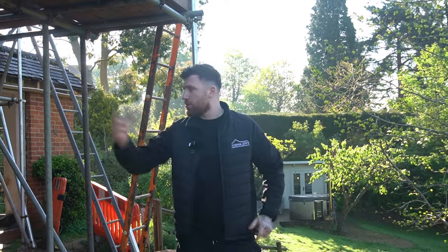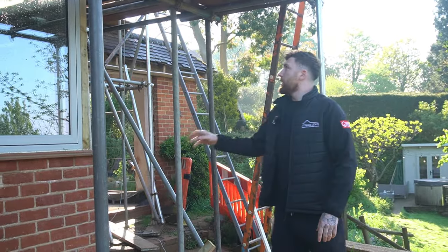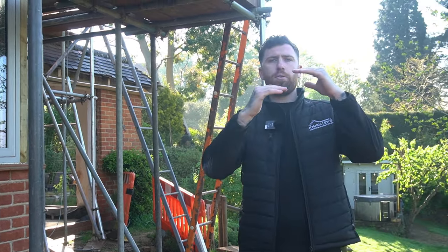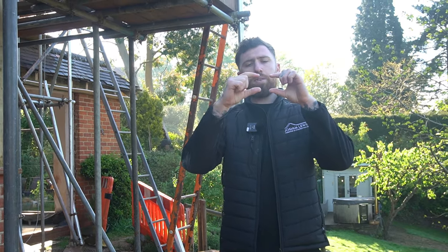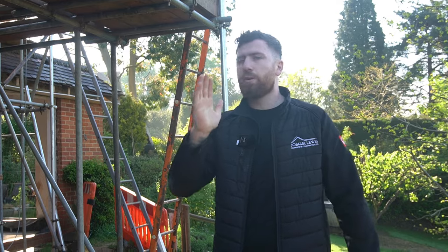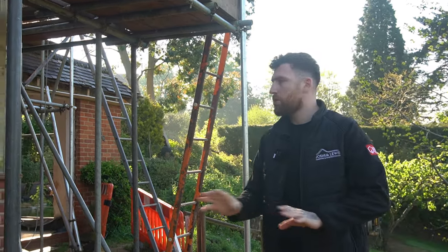While we're down here, you will see our corner glazed window is now installed. We've got a bit of a situation above, so we need to reduce the height of the window, which has been done. This allows a blind box internally. Now, this has left us with a gap about 70 millimeters on the top. We were discussing options. I didn't really want a flat trim. We've got so much detail in this corner that I think a flat trim is going to look stupid and silly.